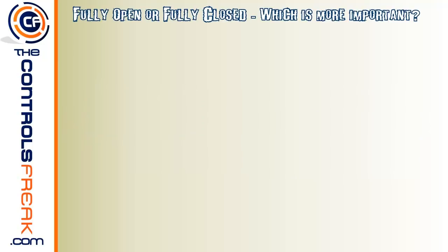So the question is, which is more important, fully open or fully closed? And the answer to that question would actually be fully closed. Most engineers and commissioning agents and so forth are going to look for zero leak by on those dampers, whether it's on an air handler or a VAV box. They're not too concerned about whether they're getting the maximum airflow when the damper is fully open. I'm going to show you why.